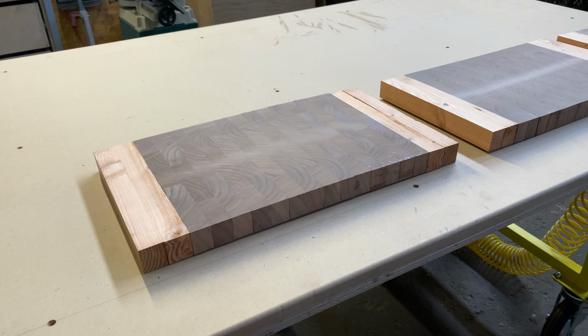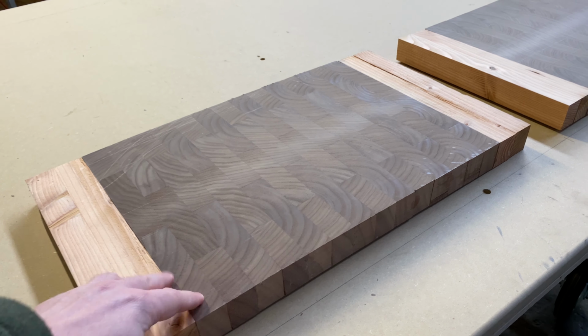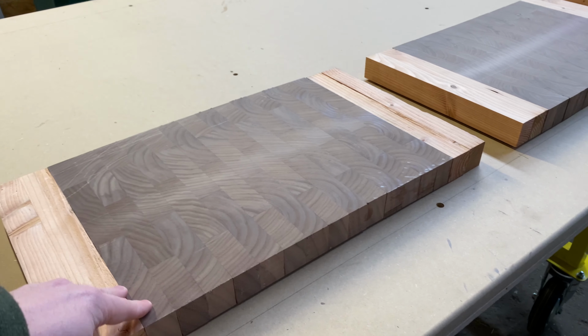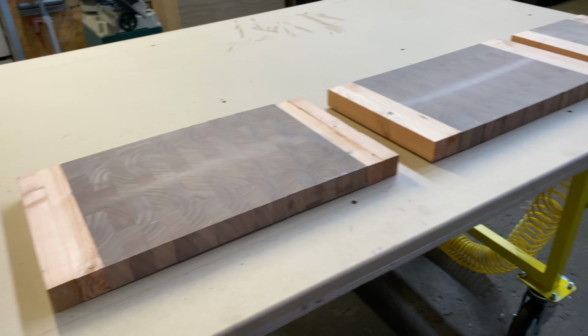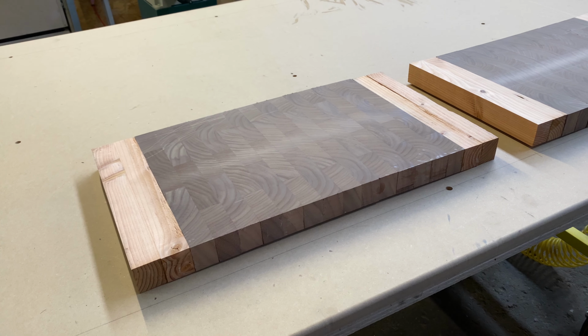I think what happened is that we had a few rainy days, and so it was more humid than usual here in the Bay Area, and the top side of these boards that was exposed more to the air absorbed a lot of moisture, while the underside didn't, and that caused this top side to swell, and it created this bow. So I could plane these flat again, except that if I'm right about the moisture being uneven, then when it dries out, it'll just bow the other direction.